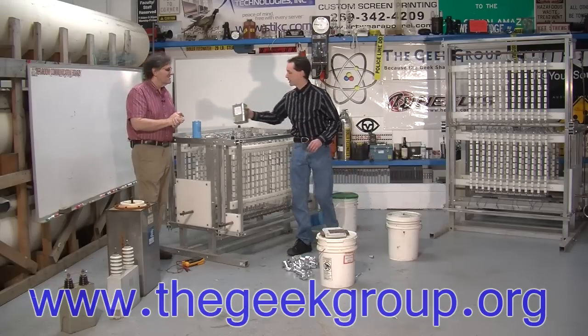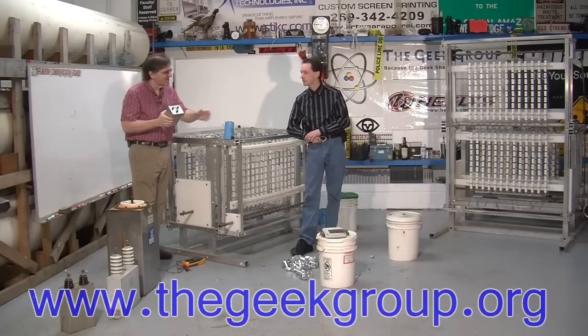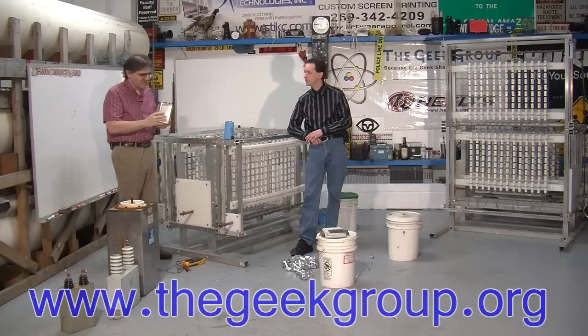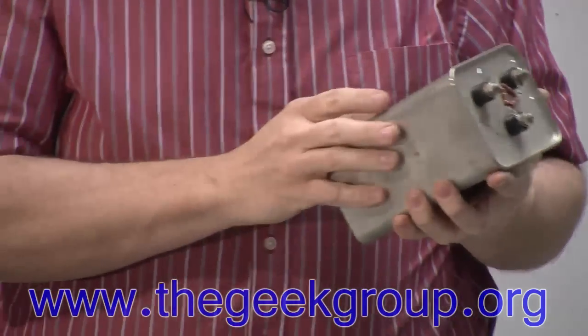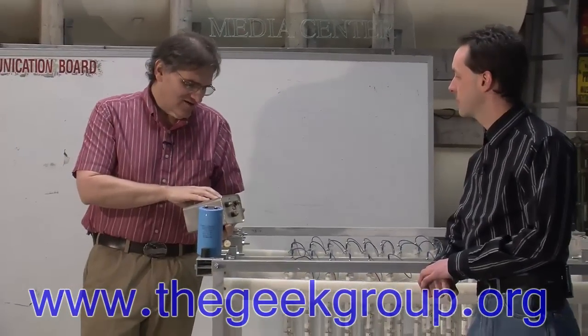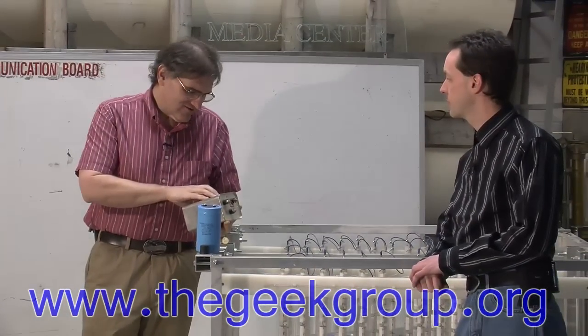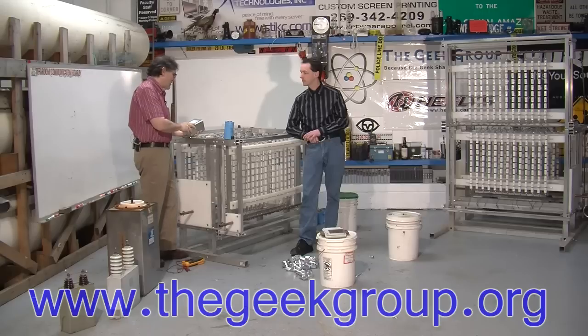All right. Talk about this one. This is a power factor correction cap, a PFC cap. It's three phase, which is why there are three connections on the top. This particular one is rated at 20 inch pounds max torque, that's the tightness on the bolts. Part number 12031-3012-001, Aerovox AMP 0010F33SA, 10 kVAR, 480 volts AC.